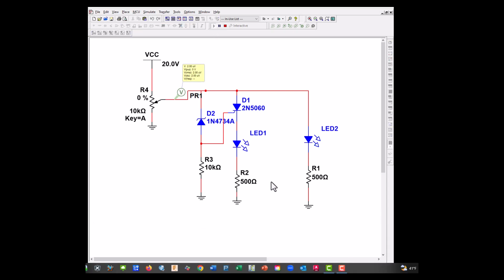circuit. Okay, so this is an overvoltage protection circuit, and let's go ahead and put enough volts on it in order to get the LED to light, and that should be a normal operating condition. There we go. And about 4.76 right at where our zener is, so that voltage is just right on the ragged edge. Okay, and so our LED is operating normally.